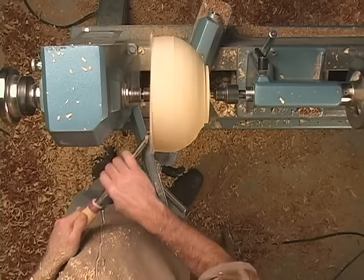all the way through. Well, the longer the sweep is on the tool, the higher the tool will have to be brought up to present it to the cutting surface. Whereas a traditional grind that doesn't have any sweep at all can be held virtually perpendicular to the wheel and be brought around to meet the cutting surface.